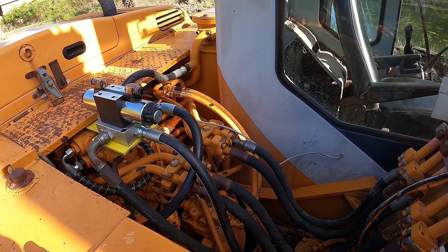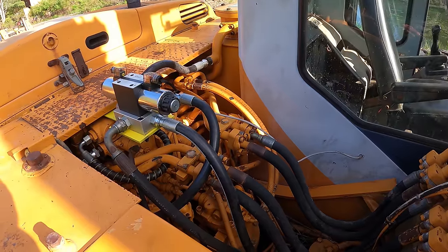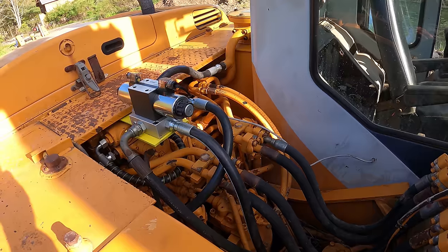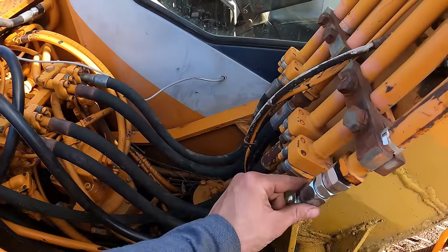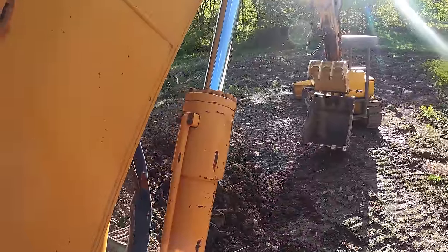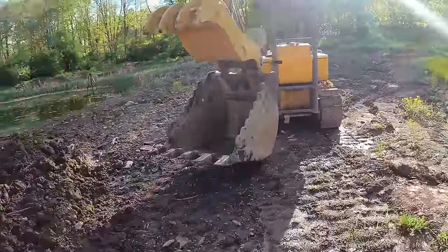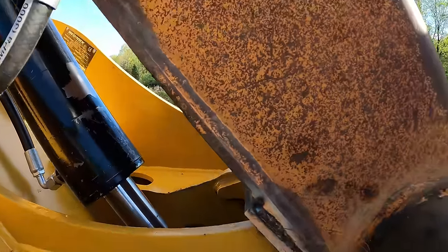There's got to be some sort of inline relief valve, which is unfortunate because I think what I would need is one for each direction at that point. Not just one relief valve, there's going to be two. Maybe something that goes on the stick, or maybe something that goes back here, gets hooked up right here or something. I don't know, but I definitely don't want to bend that cylinder or the rod inside the cylinder anyways, because I have like $500 in the cylinder